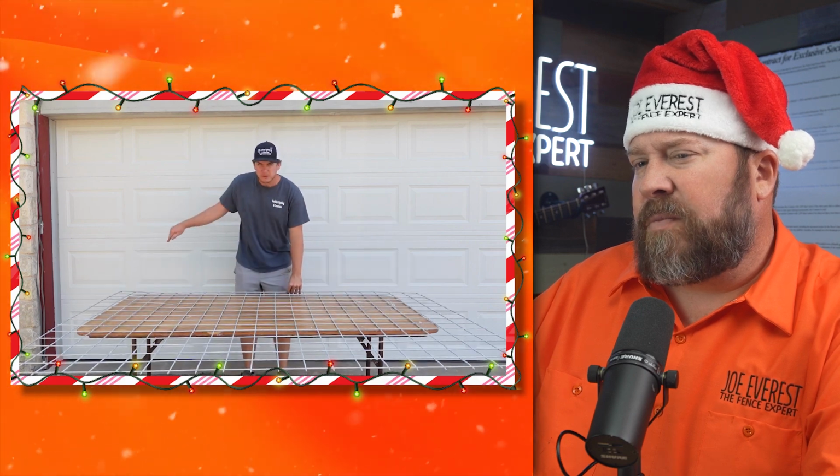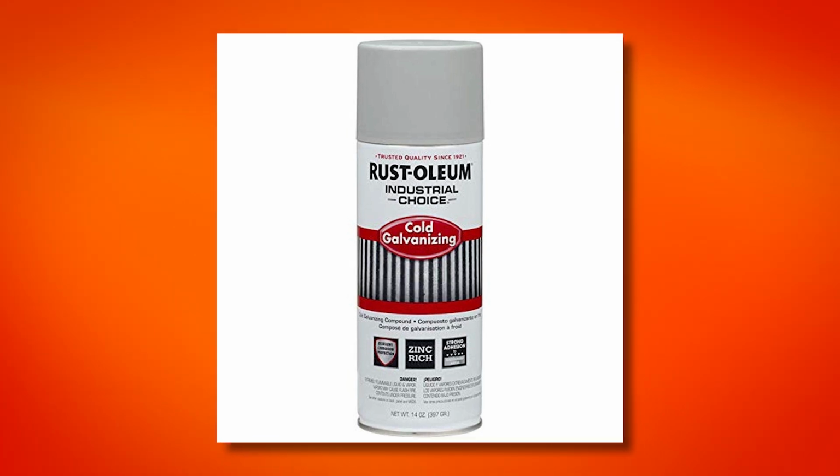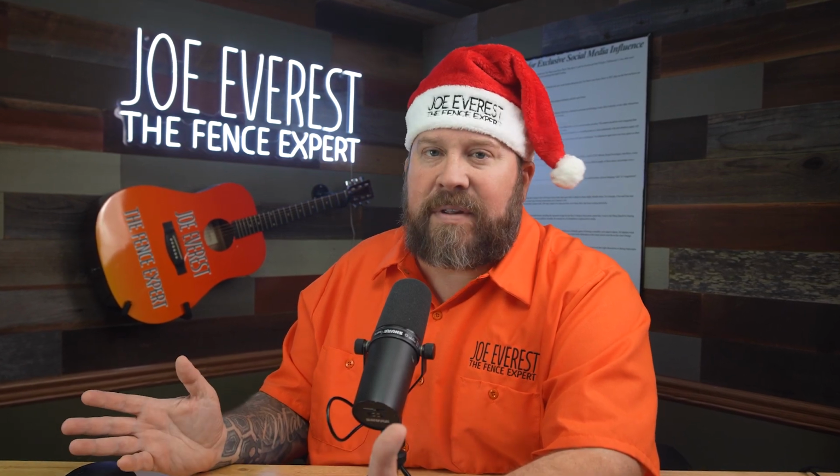They're both 21 squares. Now, one step I would add to this: these are likely presents or decorations you'll want to use year on year. Some galvanizing spray paint would probably be a better idea on the end of those cuts. It's not going to really degrade the longevity of these or anything, but they will start rusting over time. I mean, you're leaving these things outside. You definitely want to just spray those with some sort of cold galvanizing compound. You can get it at any home improvement store.